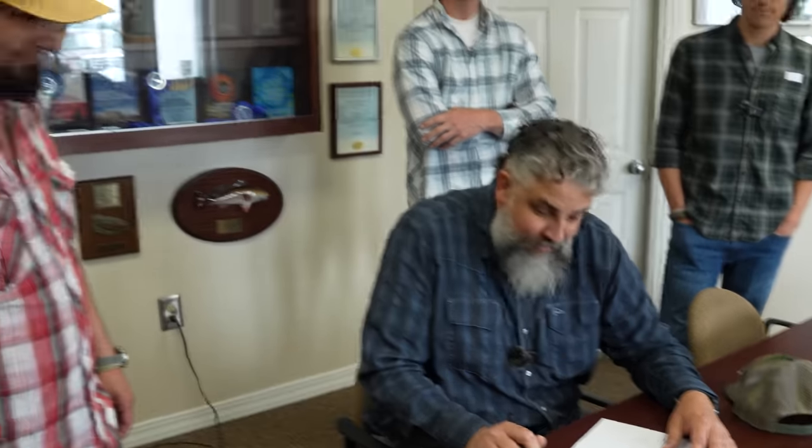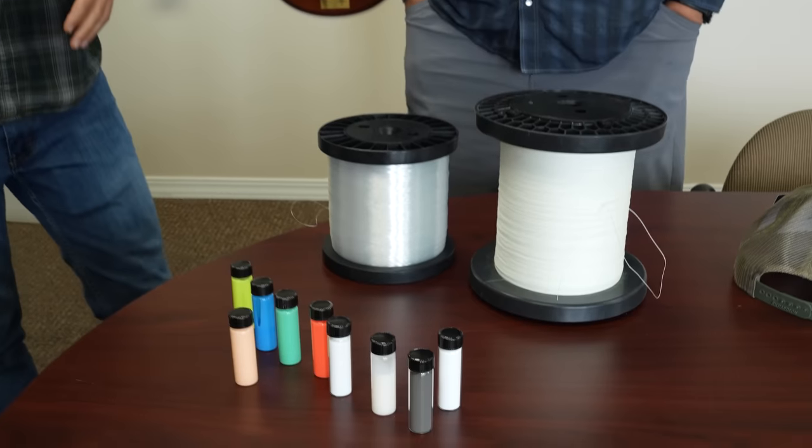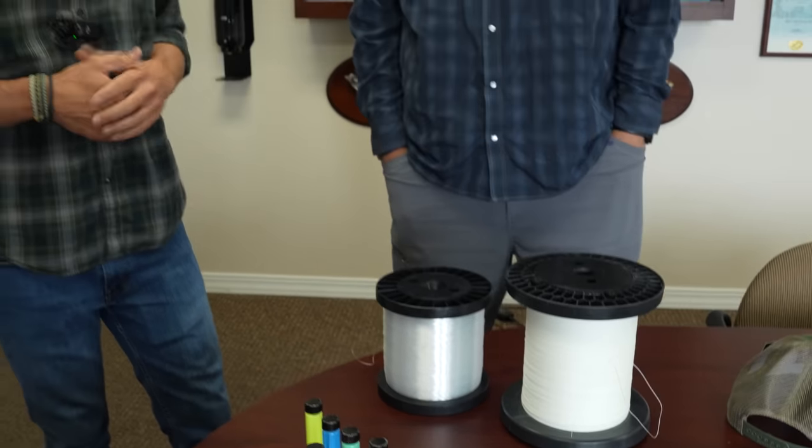There's a lot of science that goes into this that gives it that magical RIO fly line, brand new out of the box feeling. Before we get into the factory itself, there's some stuff we'll be able to film up close. Other stuff we won't be able to get on film, unfortunately, but we just wanted to give you a quick rundown of what goes into a fly line. So there's really two main components. You've got a core and then a coating. The core gives you all the strength of the fly line, determines some of the stiffness properties, as well as stretch. They come in a couple different flavors.